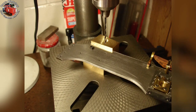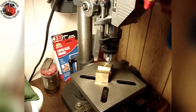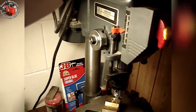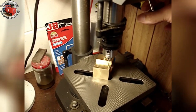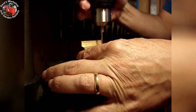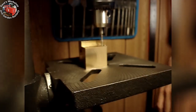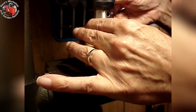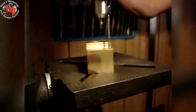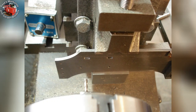Drilling through the already drilled holes in the right side frame into the right-hand cylinder block, 2.5mm diameter for M3 cap screws. Finish drilling to depth — about 10.5mm for 12mm long screws. Starting the M3 tapping using the bench drill to get the thread straight and square. I finish off by hand with a tap wrench. That's a nice square start. I have just milled the cylinder slots in the right-hand frame.